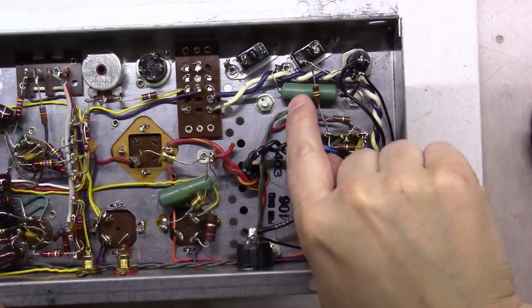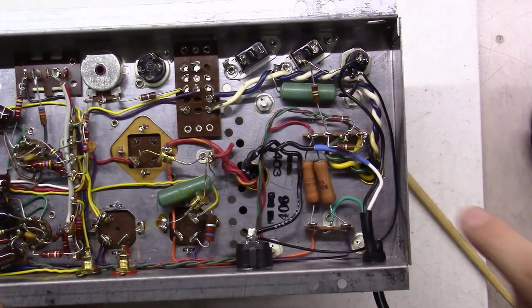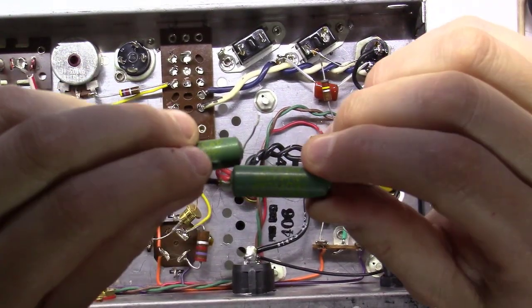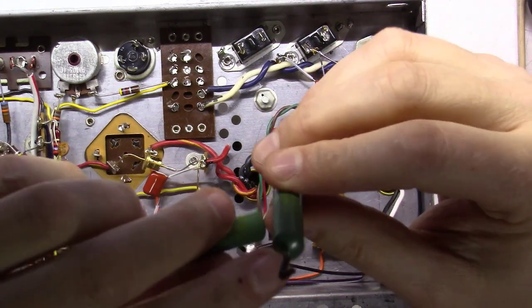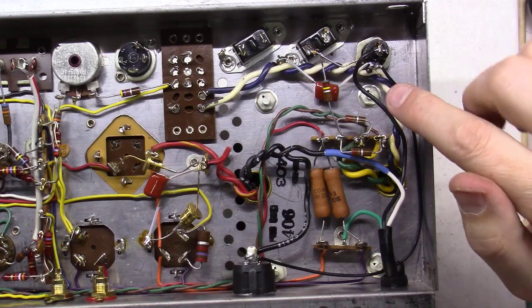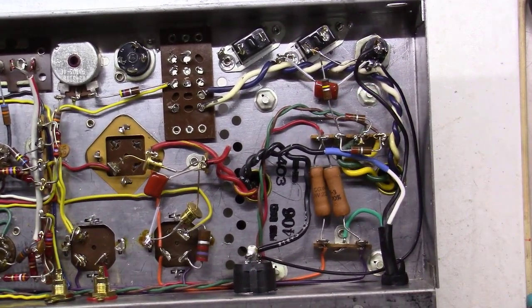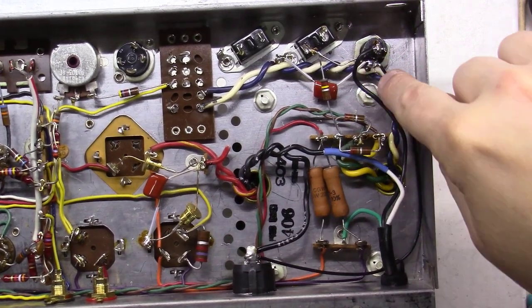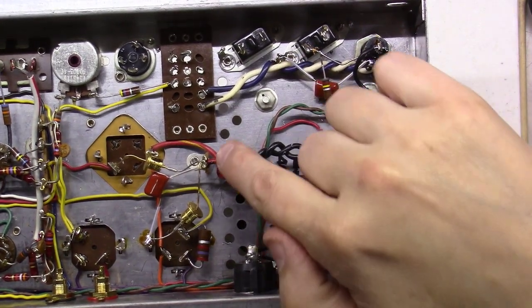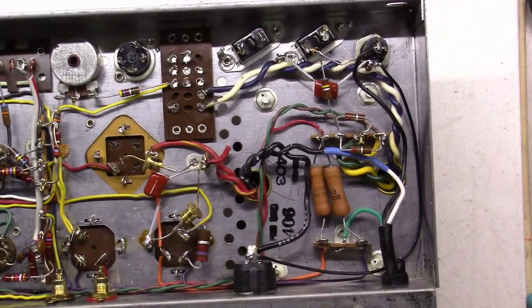Got a little noise filter cap here I'm going to replace that goes between the input here and ground. Okay, I replaced these two old paper and kind of wax plastic capacitors that are typically bad with some new polycaps. I'm a big fan of these Panasonic polycaps. They do a great job. So one kind of goes between the outer part of the fuse holder and ground over here, and then one kind of goes from this center point here on these two diodes over to ground.